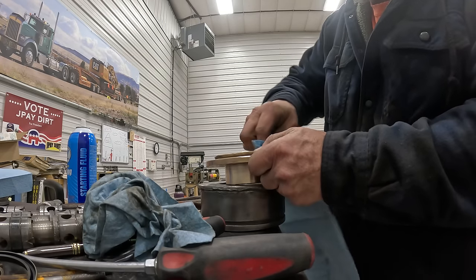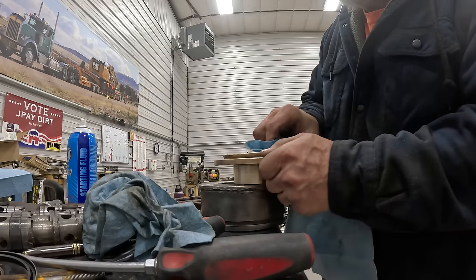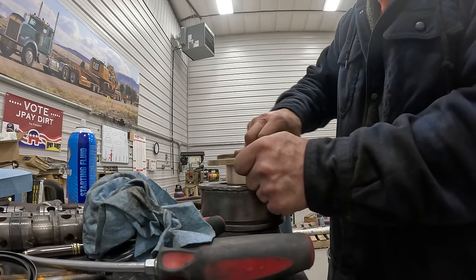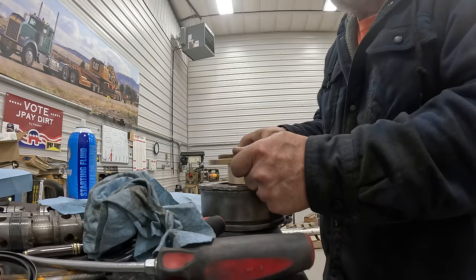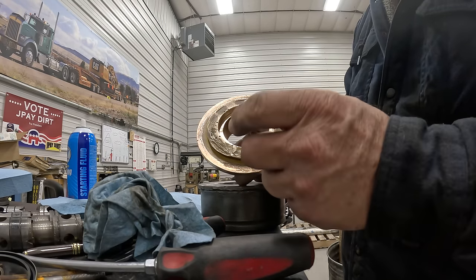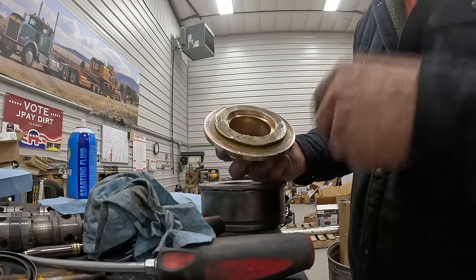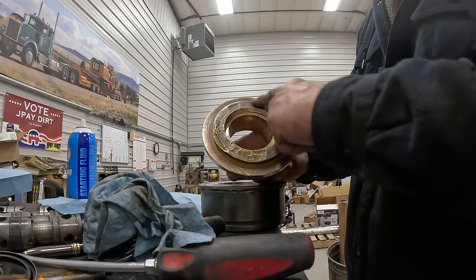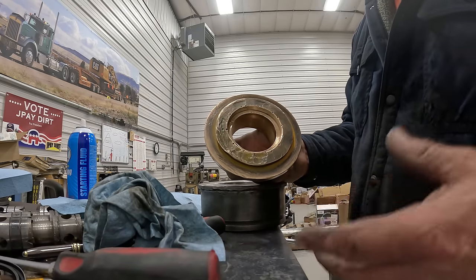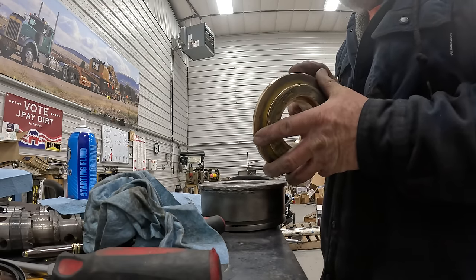This head is actually the one I had to go put on the lathe and straighten up. There was just no way I could get that round. I'll show you where that dent was. So see where they bashed it so bad right here? That was humped up and the seal was actually pooched out. I think I showed you that. But they've just beat the tar out of it. And about the only kind of punch you can use on brass would be to take a slice of Wonder Bread and roll it up. That's the hardest material you can hit with brass, is Wonder Bread.